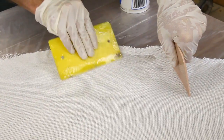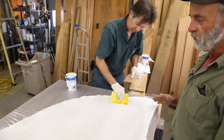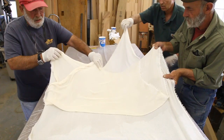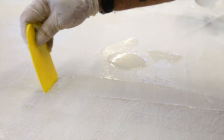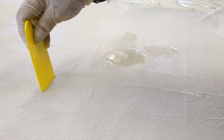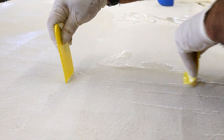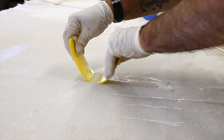The cloth floats up on top of the resin so we don't have to get it saturated right to the very edge. Up close here, this is the stem or bow end of the boat, so we're going to lap that around the edge of the stem right there. We just want to make sure it's nice and resined out because that's an important part. We're just trying to get enough resin on there — a little bit excess so that it saturates the cloth very well. Once the cloth is saturated like that, we're going to squeeze along with the same equipment here so the resin under the cloth isn't all built up in any spot.